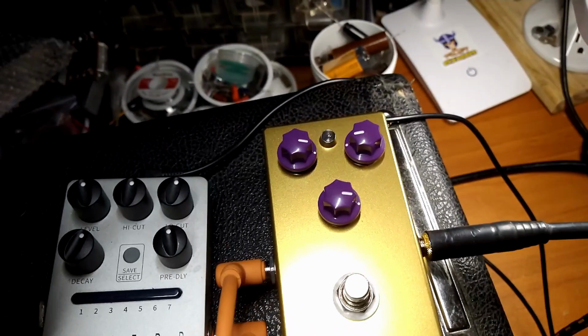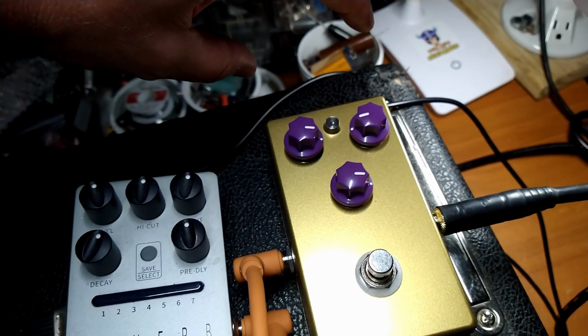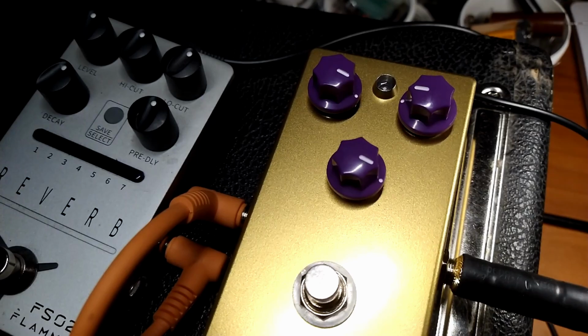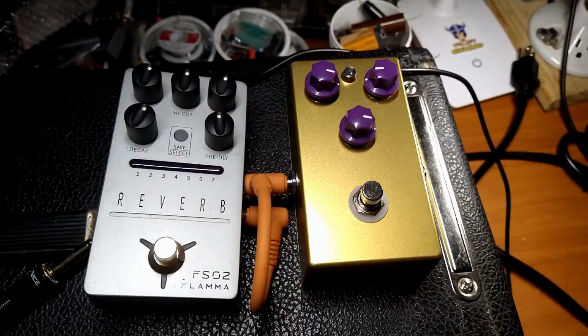I think what they want you to do is to turn the potentiometers the other way, so the top two will be hanging out over dead space, and then have top-mounted jacks, and those will slide underneath. But yeah, this is how we learn. So if you do get one of these PCBs, keep that in mind, or else your knobs will be backwards too. But there's no right way, there's no wrong way. There's only my way, I guess. I don't know what I'm saying at this point.